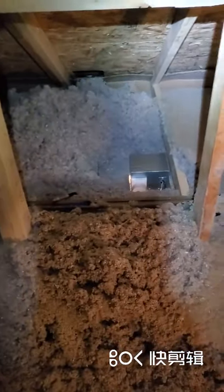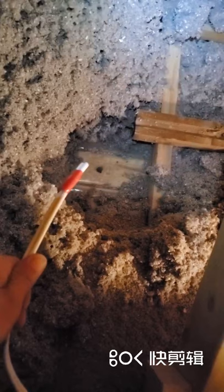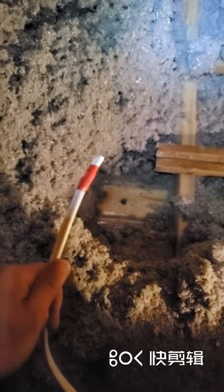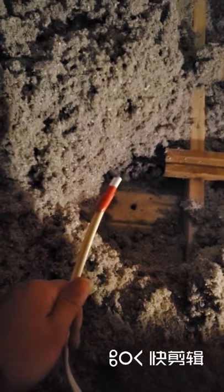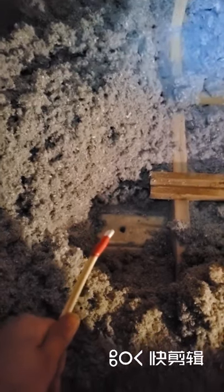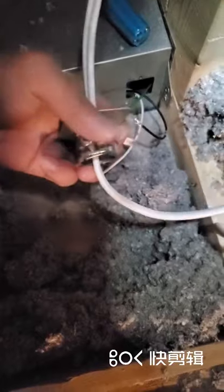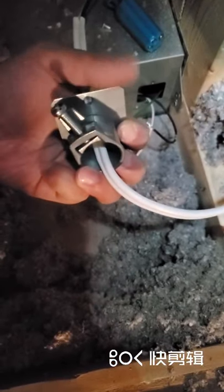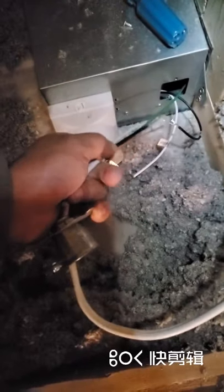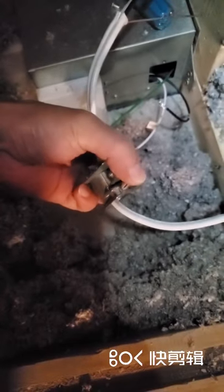The next step is to hook up the wires. I like to cut the gap before putting on the plastic cover. I'll be bringing another extra set of wires so that I could have some lighting in here, since I'm drilling the hole and running wires anyway. I taped this one so I know it will be used for power to the exhaust fan. The other wire running through the hole will be used to put in two extra lights in the attic. Once you run the wire, secure it all the way to the unit on the stud, then put the wires through one of these connectors. This metal piece comes with the exhaust fan, but you have to purchase the connector separately. The wiring is pretty simple — you have ground, neutral, hot. Put these all together, secure this metal plate with a screw on the unit, tighten the set screw, and you're all set.